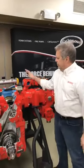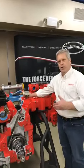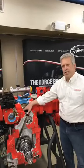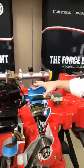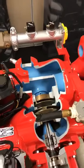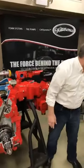This is a two-stage pump in the CM model. Our smaller capacities are just the CM, and once you add the U designation it's a larger pump internally — the impellers are a little bigger, the eyes are larger, and the passageways inside the pump are larger, so we get more water in and more water out. Let's talk in general first about centrifugal pumps — how they function and operate.